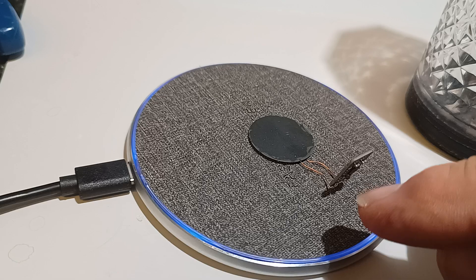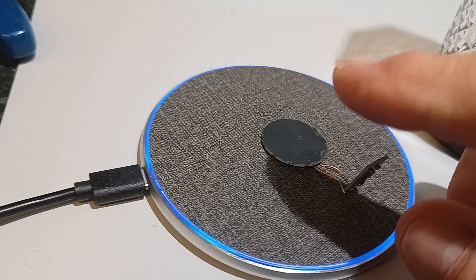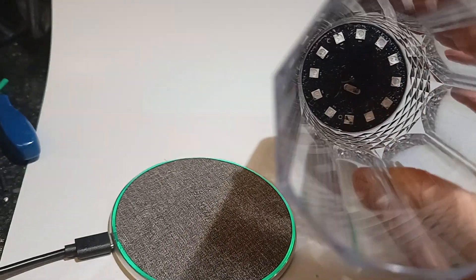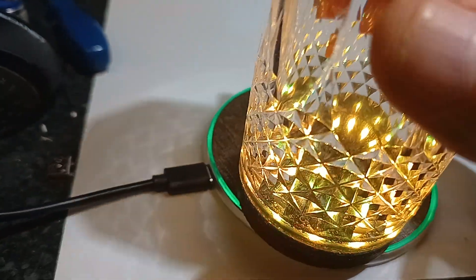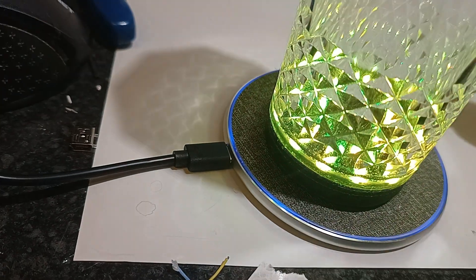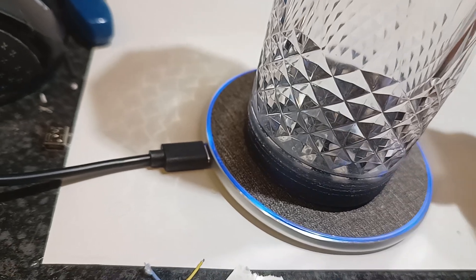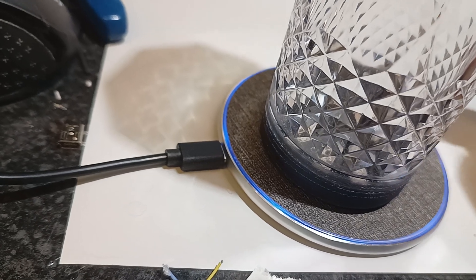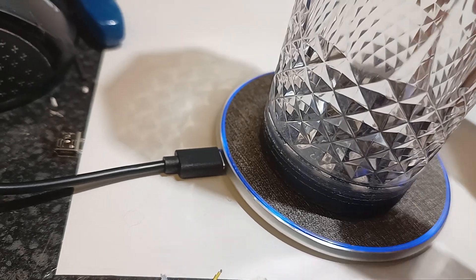You can see now it's picked up — it's now put a voltage on those output terminals. It's gone to sleep now, so if I move it, it should wake up. There we go — if you move it, it wakes up. When it goes on top of the charger, I've set it so that when it's charging, the LEDs go off. Obviously if it's charging we don't want the LEDs running. The Arduino is still running but it's only about 10 milliamps, which is nothing compared to the roughly half an amp that the battery's drawing while charging.